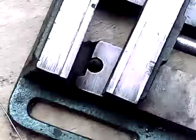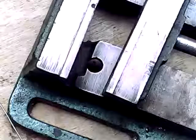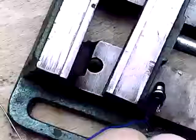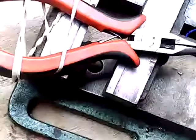Because most of what I do requires soldering. Yeah, that nasty thing when you assemble components that you just can't get by without. The cruel fact of life. Tend this up a little bit. I use the pliers for a heat sink. I have the rubber band on it to keep them closed. And this is how you solder switches, the tiny switches, without ending up with one functional switch after soldering 10 of them.